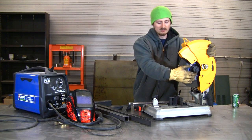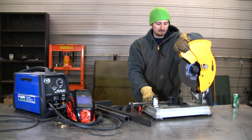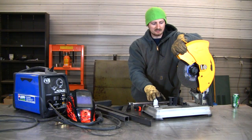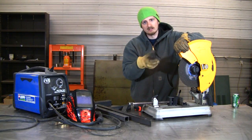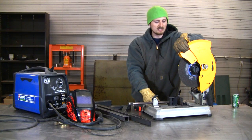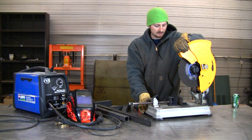I mean, this is just a huge waste of time if you have to go in there and screw around and try to hold it all and get it undone. So this chop saw has a lot of nice features. It has this toolless blade removal, which is basically a locking wing nut that you can just unscrew and the abrasive blade pops off. You pop a new one on, screw it down. It's a 2-minute job instead of a 15-20 minute hassle.